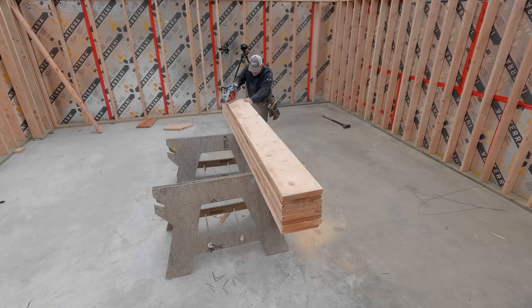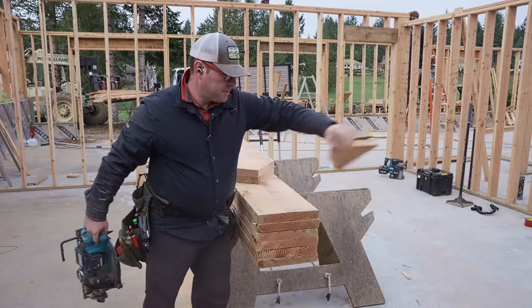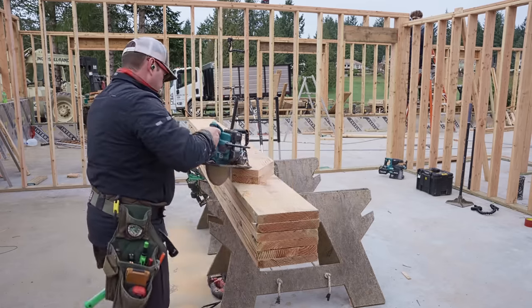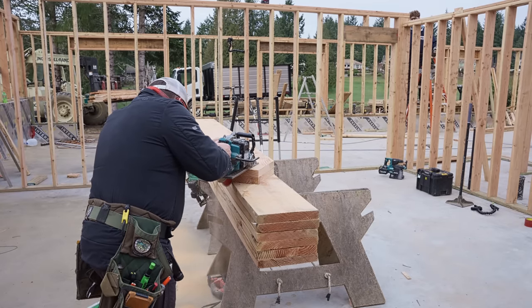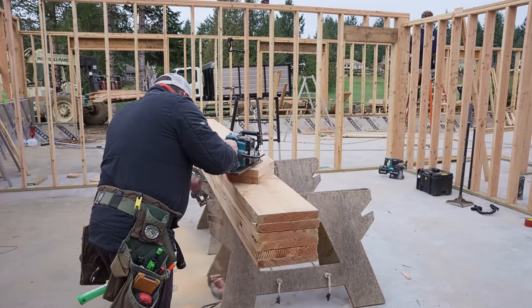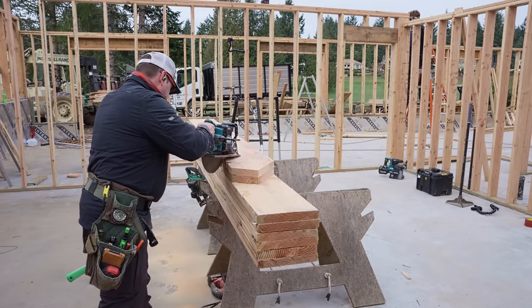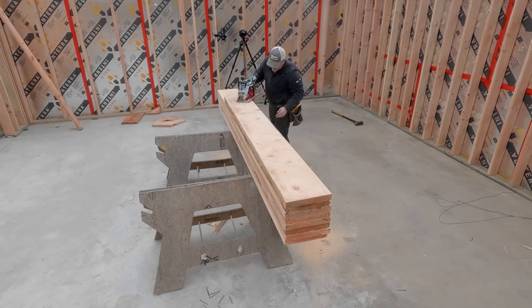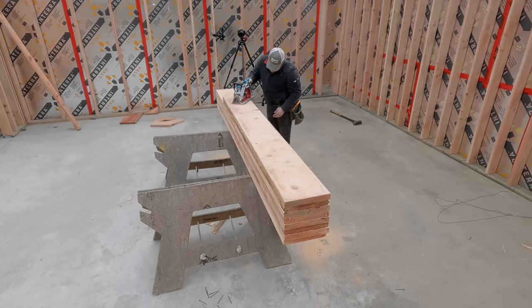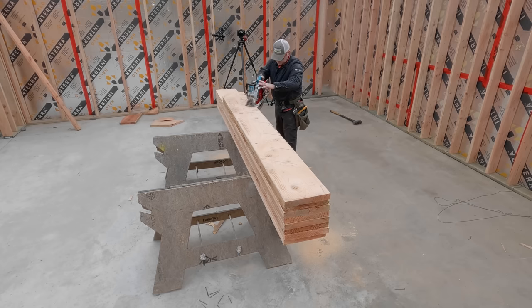Now, it's a 10 1/4 inch Diablo blade. That has been my blade of choice going way back. I can cut through 2 pieces completely. It cuts about 3 3/4 inches deep. So essentially, I'm cutting the top 2 right up to the line where the riser intersects with the tread, and that scores the piece underneath. That is going to save me time because I'm not going to have to scribe each of these. Typically, what we do is we cut a pattern and then we would scribe it 7 more times. I don't have to do that. I'm just going to keep cutting and cutting.